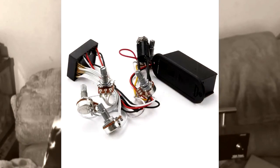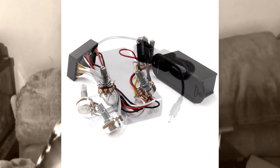And then there's something called a voltage regulator. A 7809 is the model number. So let's say you have 20 volts or 19.5 coming in, you would split that off and run that to this voltage regulator. Those have 3 legs. The power comes in at 20 volts, and it comes out at 9, because it's a 7809. If you got a 7805, it would be 5 volts. Basically, that just drops the voltage down. Then you could run the EQ section, your preamp would be powered off the same power supply. So you have one power plug running everything.